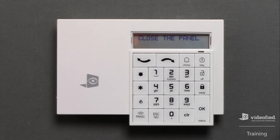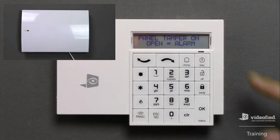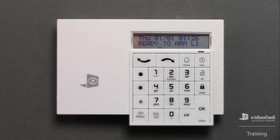This leads us to the one final important step, which requires that we place the cover on the panel so that the tamper is secure. Once that step has been completed, take note of the 'Operation Completed' display. It is important at this final stage to ensure there are no open devices, as the panel will run a systems check after pressing OK. If any faults are found, such as an open tamper, it will temporarily stop completion of initial programming until all faults have been addressed. I've ensured all devices are secure and I can press OK. Finally, look for the 'Installation Successful' status display and then the 'Ready to Arm' home screen. This will indicate initial programming has now been completed, which brings us to the conclusion of this instructional video.